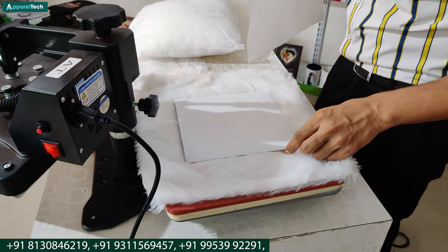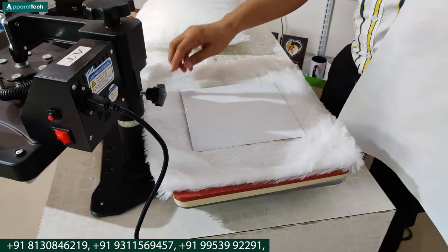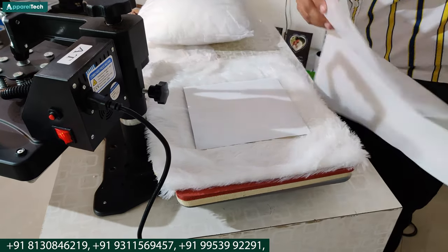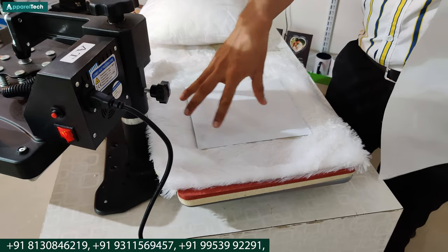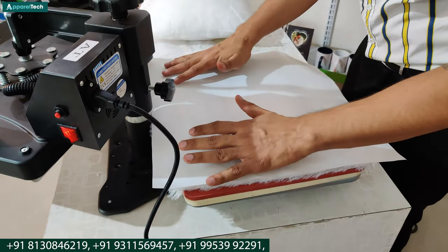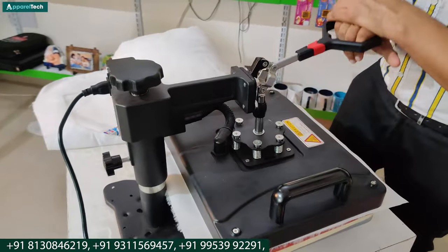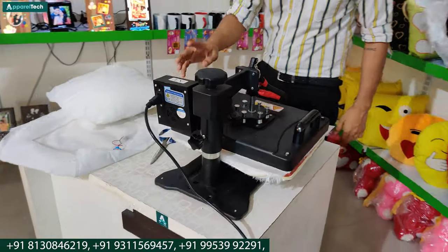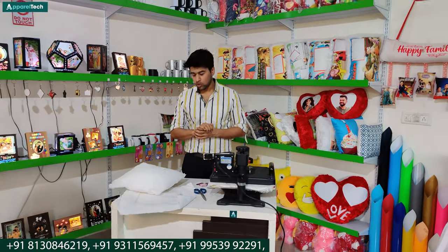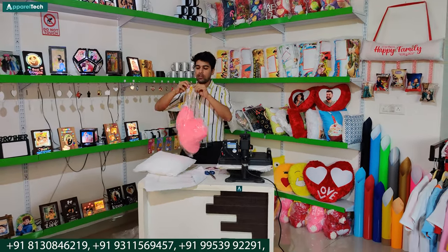We have taken a cushion and done cutting with it. Their hands have been cleaned. They don't need to use tape. But if you are starting a new job and printing for the first or second time, I will advise you to use the tape. Because after sublimation printing, it won't come out once again, and your product can be wrong. As we are looking at the temperature of the machine, we will show you the next product.